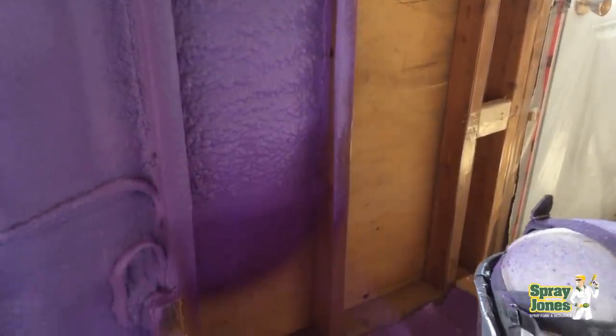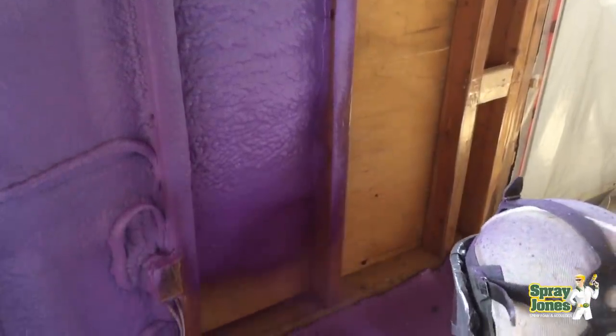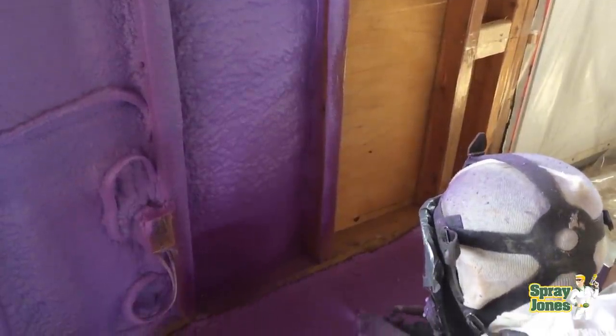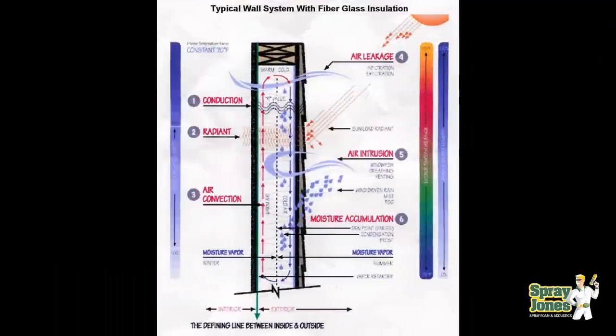This is why the fibrous industry and insulation industry through 40 or even 50 years of 2x4 walls have not been able to solve this problem — it is an air leakage issue. Unless they stop the air, it won't be solved. And if you go put poly up and then put sheetrock up, you increase your air leakage rate by 400% as soon as you put the screws through it. Don't think that poly, tape, and acoustical sealant will solve the problem — that's only temporary until you punch it full of holes.